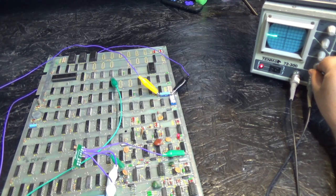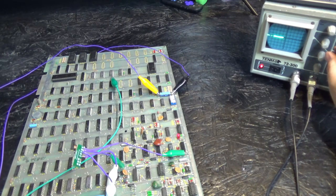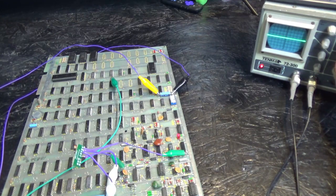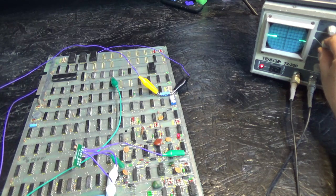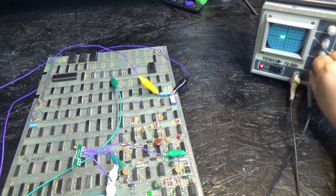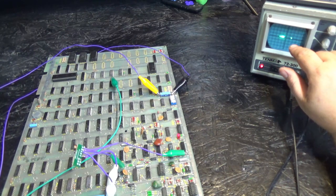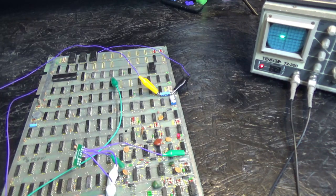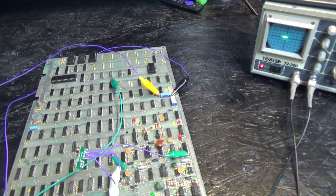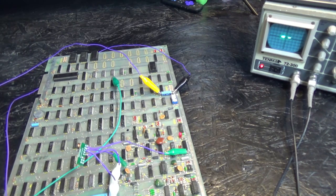Okay. Something is clearly wrong, right? But it's actually looking pretty damn good so far, isn't it? Okay, let me adjust this a little bit. It looks like the game is playing, but we're missing an axis. I'm mispronouncing that, I know. Okay, so is it this one? Disconnect it. Nope, it looks like X out is working to some degree. And over here, Y out, nothing changes when I disconnect that.